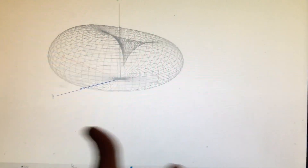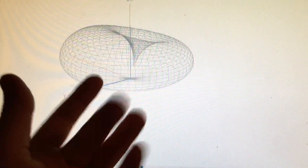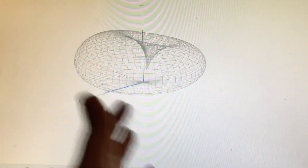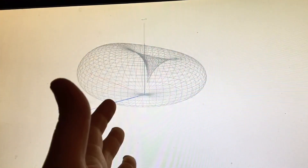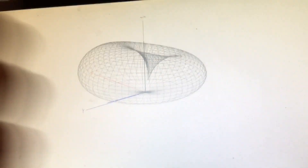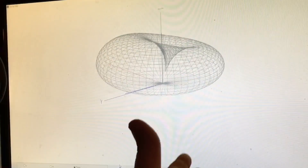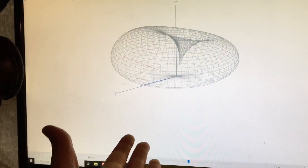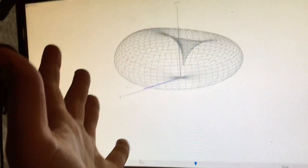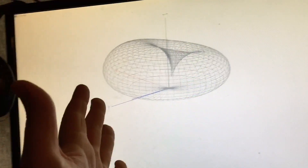I'm going to assume in this case that you do not have that much coaxial cable — maybe you've got like nine feet — and you don't have a bunch of rope to hang this thing up. Maybe you got a shoestring, maybe dental floss, maybe nothing at all. What could you make realistically? That would be an L-shaped dipole on the ground. I've made L-shaped dipoles before; they work fine, they're not the greatest antenna in the world, but people use them all the time. Hams still use them as compromise antennas.